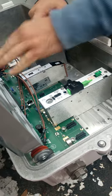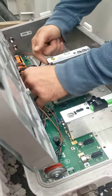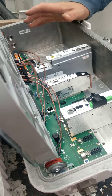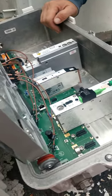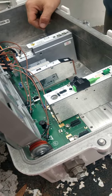In the return transmitters, there's a slot right here called the SFP slot. It's a little card. It slides right in there. It's dummy proof. You can't screw it up. Do I plug some fiber in there? You do. Your return fiber goes in that. Your forward fiber goes forward in there.